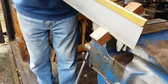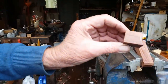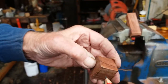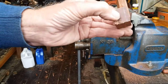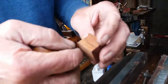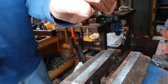I'll use this saw now. Let's see what I've done — cut the rebate next. I told you it's going to be a little round there, so I'll draw that line in. You can gauge this — that's near enough for William. Now I've got that saw cut there and that's sawn off. I told you it's going to be a little sixteenth of an inch rebate. I've got my gauge still set up. A little tiny rebate.